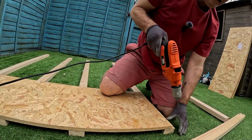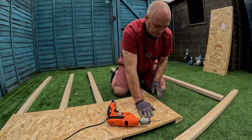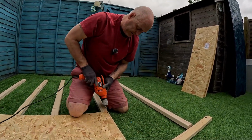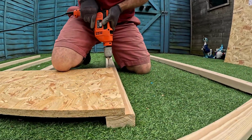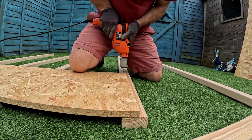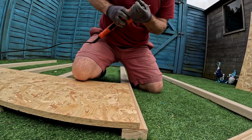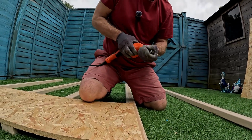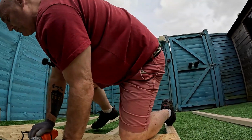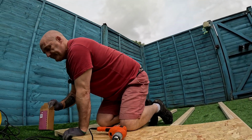And don't forget, the key now on this bit of wood is to leave half of the supporting strut empty, so that when you support it to the other bit, you've got another bit of wood that can go across there. So again, and where you're so near the edge here, if you didn't, it would simply split the wood. So again, undo this, take that off. Again, keep the wood solid so everything underneath it stays in place.